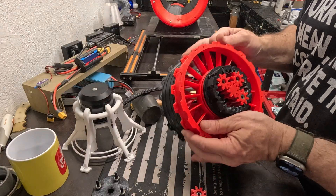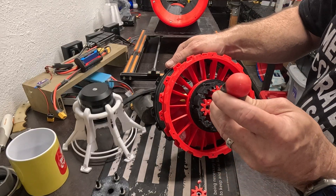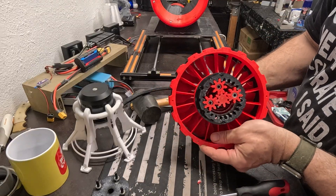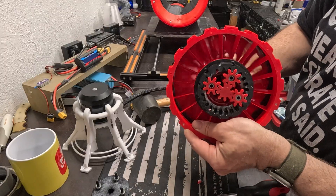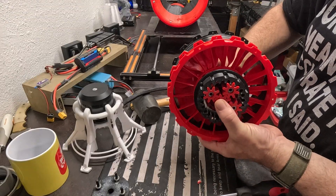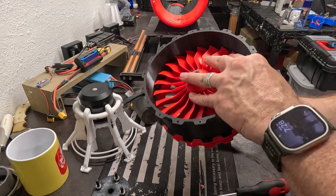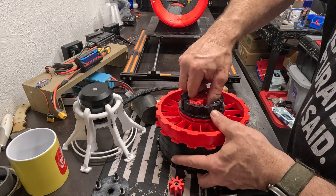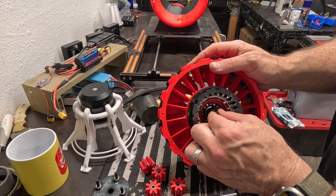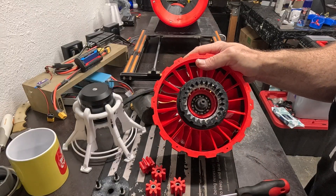Other than that and the little pieces of tooth right here, which we'll get out of there, I'll just reprint one of the gears. The planetary is slipping too — the planetary must have also given out after the gear index. We'll pop the rest of these out. Yeah, it rounded off the hexagonal index — you can see the front's hexagonal and it rounded that off, and there's another piece of tooth in there. So it was just the gears.